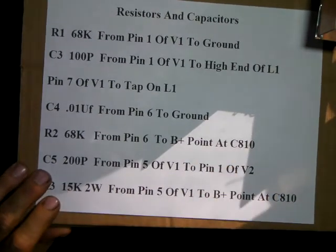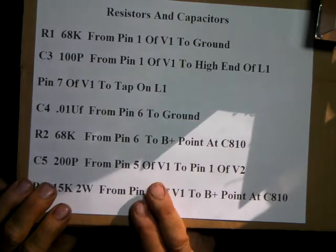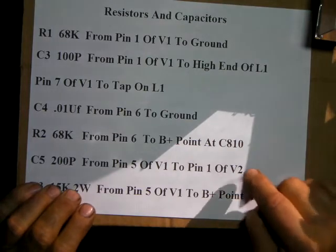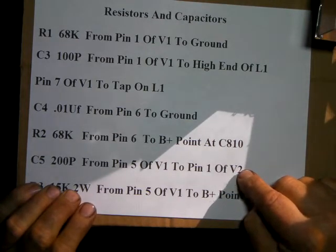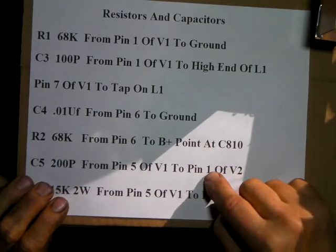C5. It's a 200 puff. Goes from pin 5 of V1 to pin 1 of V2. Now we won't solder it to V2. I'm just going to go ahead and lay it in there because there's going to be another resistor in the next video that'll be attaching to that pin 1.